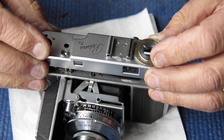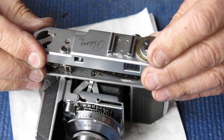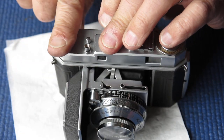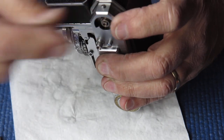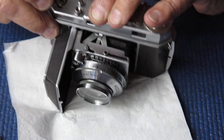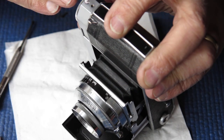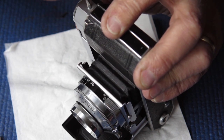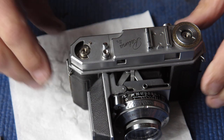The top cover is in place. Before I took the film advance lever off this camera, I made sure that I had the film advance lever out at 90 degrees from the body — that makes it easy to put everything back together again afterwards. One of these screws for holding the top cover in place was not the correct one — it's a longer one. A longer screw must go at the viewfinder end, not at the film advance end, because at the film advance end it would foul that plate inside there.